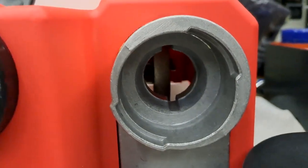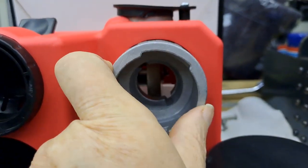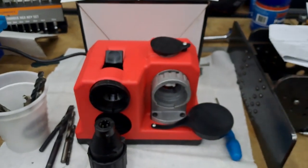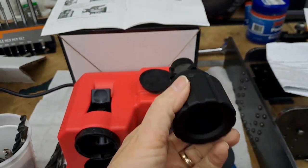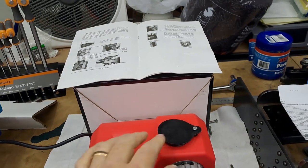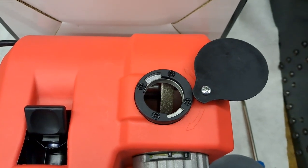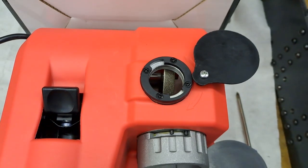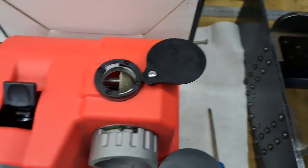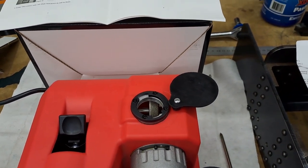You can see the locating slots here, because this whole thing walks back and forward. You do that until the grinding noise stops, and then you turn the whole thing, pull it out, turn it 180 degrees, slot it back in, grind, grind, grind. They also suggest using the top attachment, which puts what I think they call a split point in the end, although it doesn't seem to make a great deal of difference to me. I'll just be happy if I can get these drills sharpened — although if you buy drills like I do in packs of 10, they're less than a couple of bucks each, and it's probably better to just bin them and get a new one out of the packet.